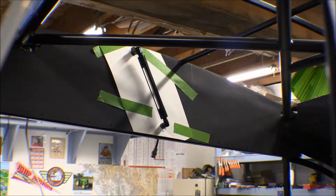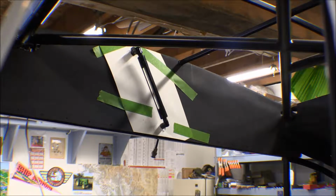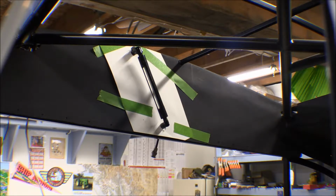When I'm working on the wing roots on the fuel gauges there, I took the fuel gauges off, took them all apart, cleaned the glass out, got new gaskets for them, and I got new BBs for them, the balls that float up and down to show you where the fuel level is on them. And I've got decals for them to put up there, but I don't think those decals will stick to this plastic that the headliner or the side panels are made out of. And even if they did, I think it'd look like crap because this is pretty textured there, and to get them to sit right, I don't think they'd ever line up right. So I'm going to make a panel for each one of those to kind of back behind those fuel gauges that I can put that decal on for the fuel level.